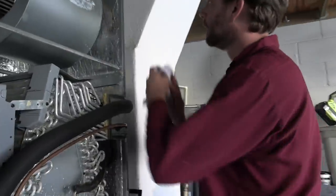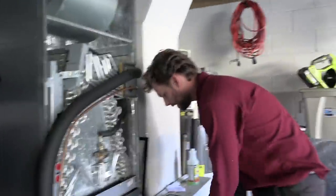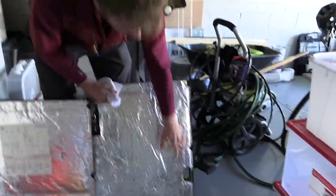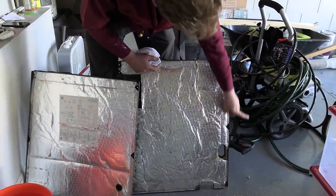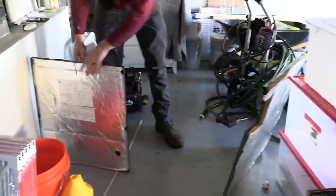I'm going to wipe down panels in here — everything that I sprayed on the inside of my panel doors. Often these can be pretty filthy, so we'll spray them off and wipe them down. If the insulation is starting to come off, we can spray glue that down; for really bad situations, use some silver tape and actually pull it over and secure that. Something to always look for on your maintenance.